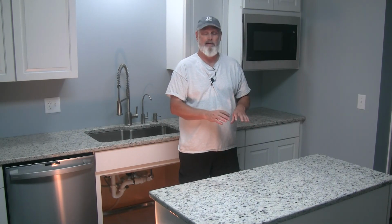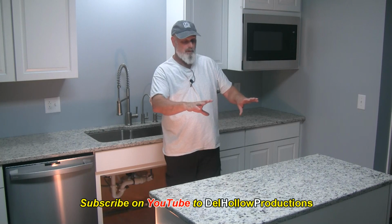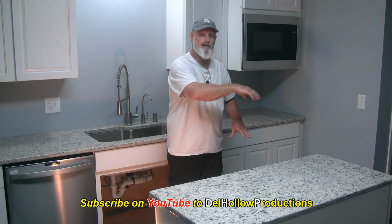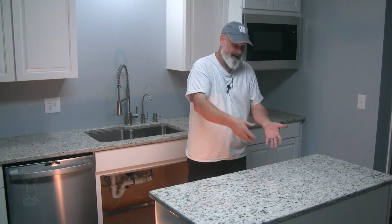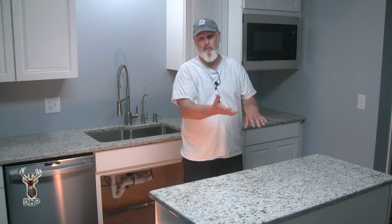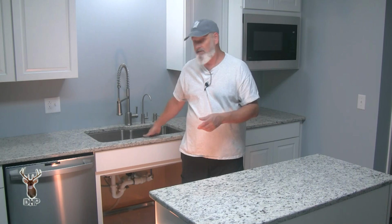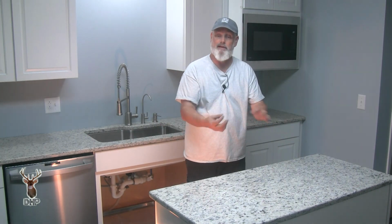Now, a big slab like that has a sinkhole in it, they're very easy to mount. Because what we'll do is we have just a hole in it, a lot of meat around the rest of the countertop. We'll flip that over, get it on the job site, locate that, run a little bead of silicone around the sink itself and it's good to go. If we don't have a template, we've already measured out and we've got our sinkhole cut. So we just drop it in there, get it about right, make sure we feel it, get the right perimeter,